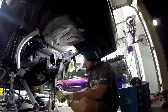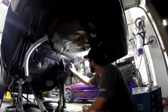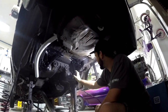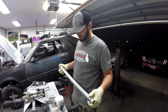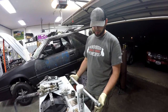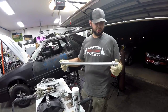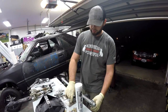Now we're going to test fit the anti-roll bar. What I noticed online is a lot of people don't coat these things. They come zinc-coated, so they are a little bit rust-proof. But I went ahead and rust-proofed it myself with some Rust-Oleum chrome paint you can buy at your local car store. I have the chromoly front suspension and it really looks like a chrome powder coat. I taped up the ends so no paint got on where the bearing is going to ride.